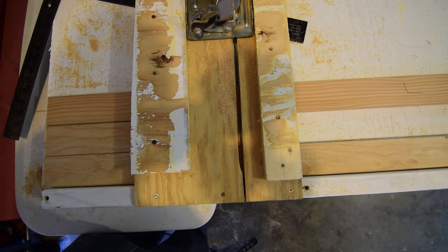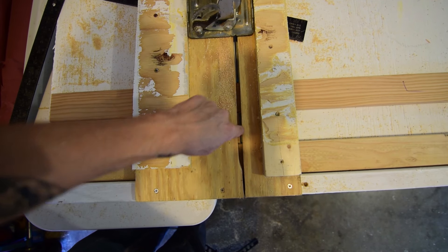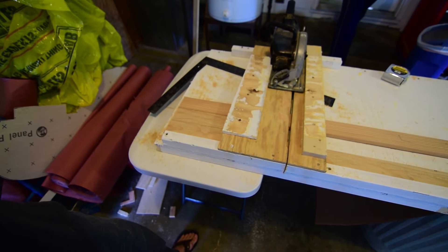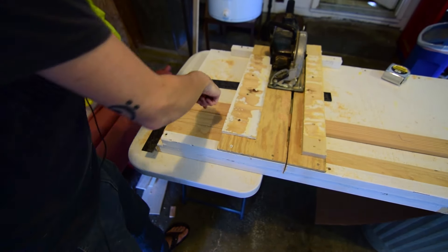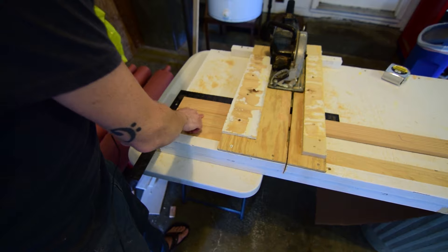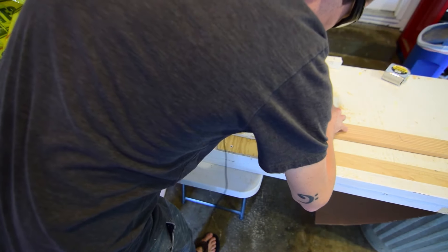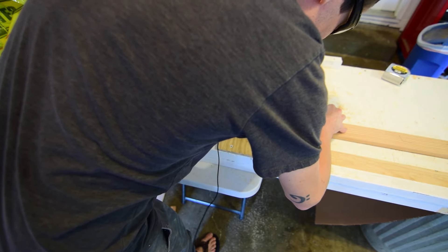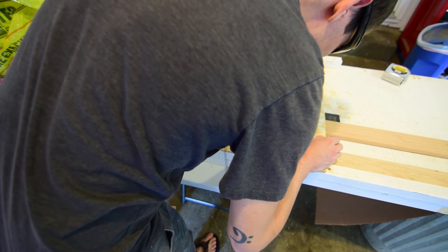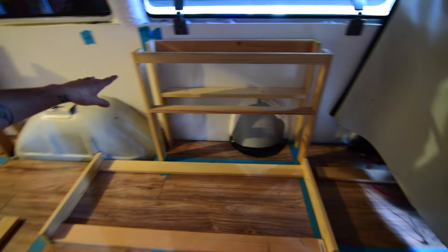This is working out great — I get perfect even cuts on every single one. I've got this nice little peephole I can line everything up, and then I take the square here. I know this is the piece that's already the right length. I had to cut six pieces, so I just line up the square, get them all evened up, push them in, make sure everything's straight, and I look down in here and push it over because I know how thick that saw blade is. So far this has worked out absolutely perfectly.